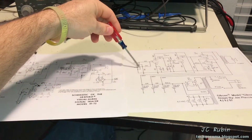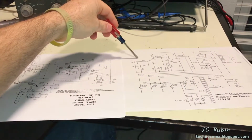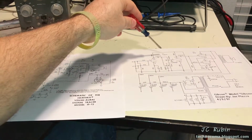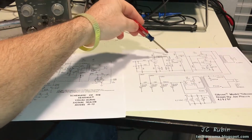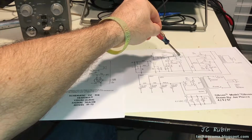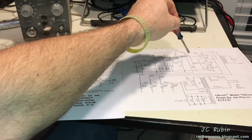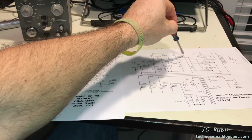And the inputs for the Gibsonette are 2 jacks. We're only going to be using 1 in this circuit, and we could see some cathode biasing right here, and some tone knobs, which won't be in the first iteration, but it'll make its way in the second, and basically makes its way out right through this coupling capacitor here, 0.022 microfarads, right? And then we're not going to worry about the final stage right here. This is the demarcation point, right, where we pass it off, right?